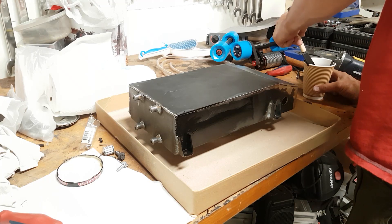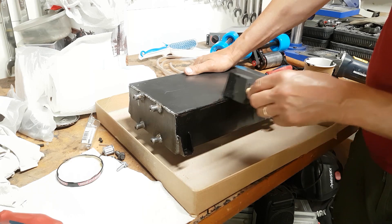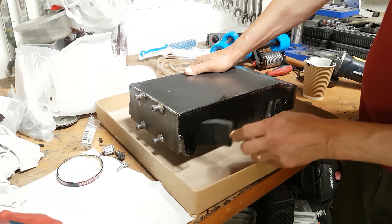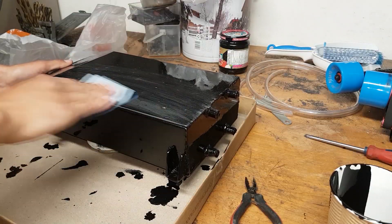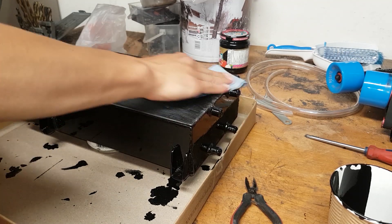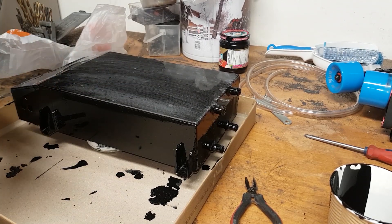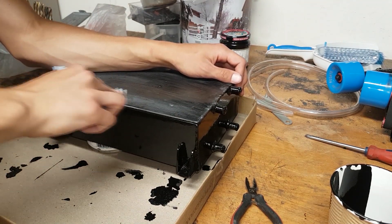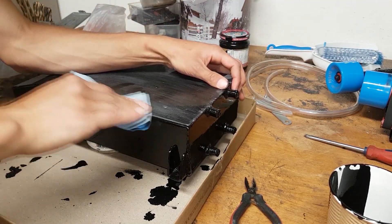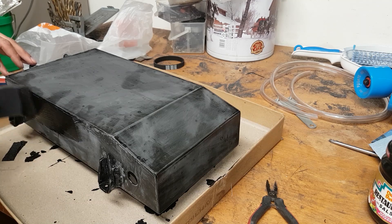The next step was paint. I didn't put a huge amount of care into this — I chose to use what I had lying around, which was POR-15, a paint you can use directly over rusty surfaces. It's a little expensive and definitely overkill for this project, but it would do a nice job of hiding all the imperfections. With very little surface prep — basically just wiping down the box with lacquer thinner — I ended up with a pretty shiny finished project that didn't look half bad. I then sanded it down and applied a second coat to get out surface imperfections and make sure it was nice and thick and durable.